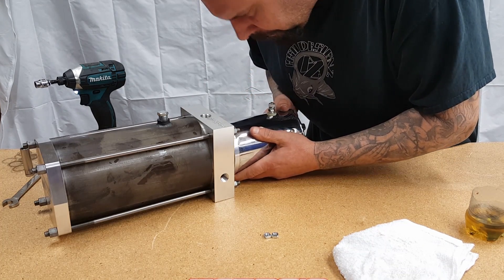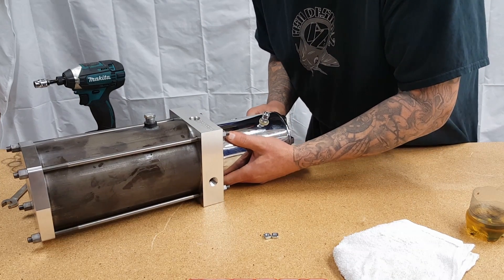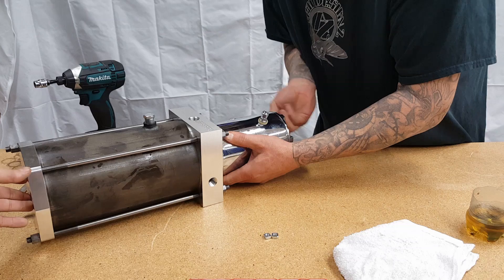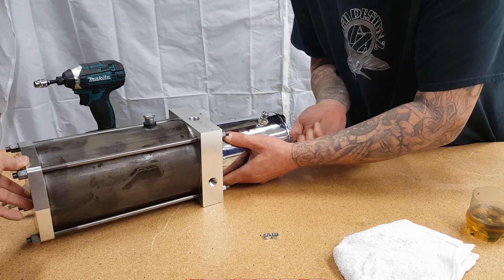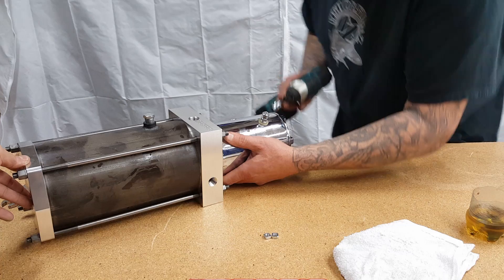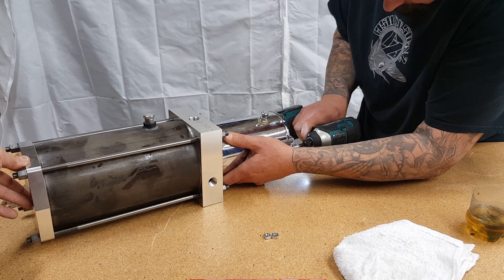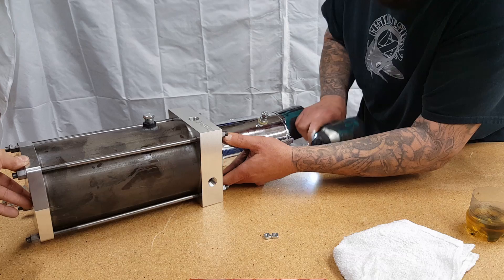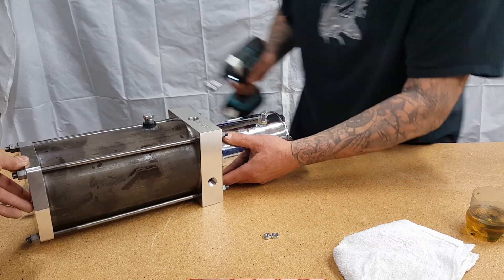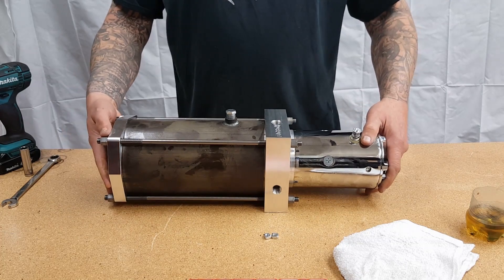You want to make sure it's safe to grab — hold it firmly from top to bottom, make sure you don't just grab the top cap. Eric is putting on the motor and lining up the teeth on the gear and the key. He starts the bolts by hand and then works his way in with the impact. On these you want to be careful — you don't want to go too tight because those rods are pretty thin and long, so they will have a tendency to break.